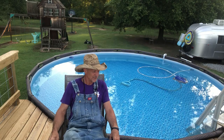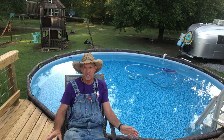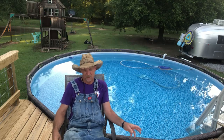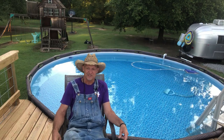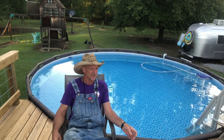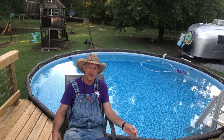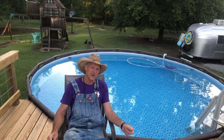But guys, that's all the advice I got for you on keeping the pool. The main thing is I'm doing awesome with it. Now I know if you're a working person you ain't going to want to come do this every day, but if you'll do it every other day or every three days — keep that trash out of that skimmer and out of that vacuum cleaner — I think it'll cut down on your having to use chemicals. Also it's going to depend on how many people are in your pool, how often, suntan lotions and all of that. The more people you've got swimming with sunscreen and sunblock on, that contaminates your water and you're going to have to treat it more often.